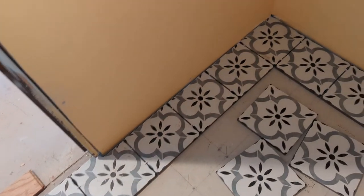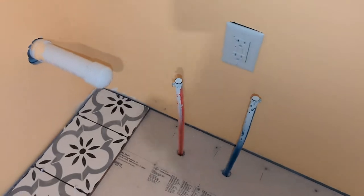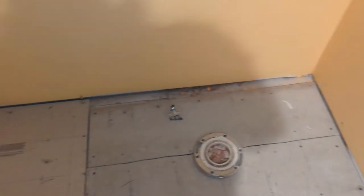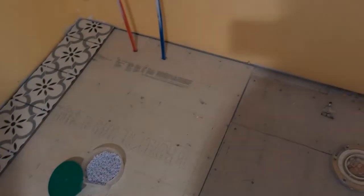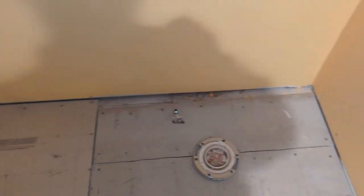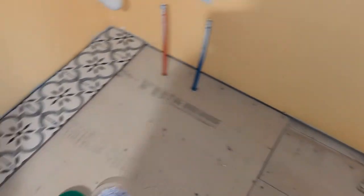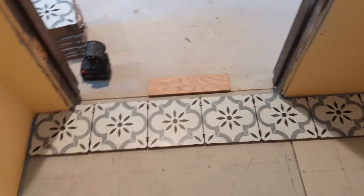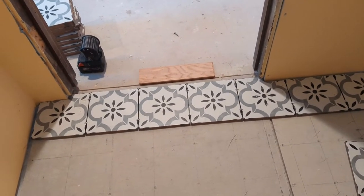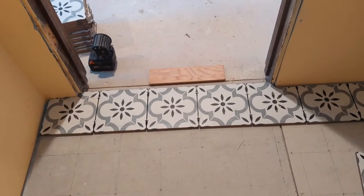What that means is if you're going to cut tile, you want to go to the back of the room and cut it there, because back here I've got the vanity and over here I've got the toilet. The cut tile is going to have much less of a visual impact back here behind the room. But when someone walks into the room through the doorway, that's the first thing they see, and you want to show them the full tile in all of its glory.